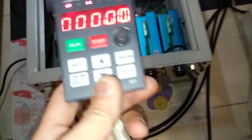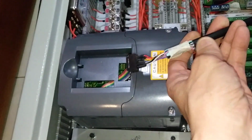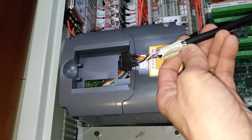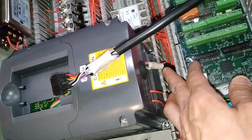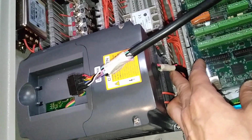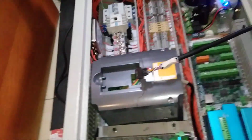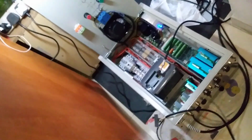And one thing is that the connecting cord for them must be a shielded cord. It has wire mesh and also thin aluminum foil shielding, as well as the spindle power cord, the cord for the spindle via the UVW wire. This is also a shielded wire to prevent interference. And thank you for watching.